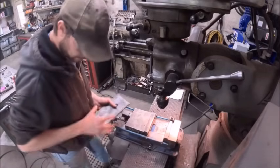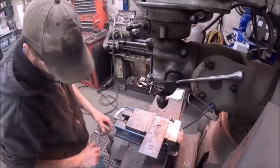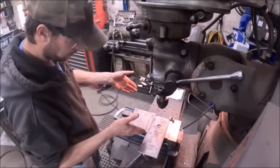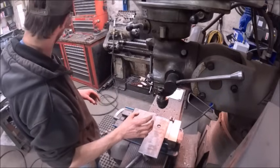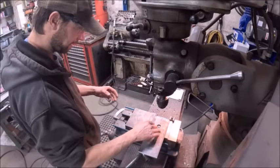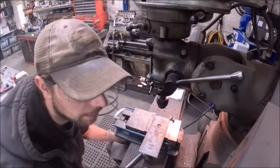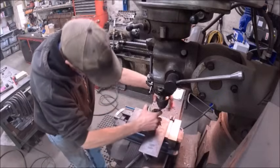So as far as this piece goes, we actually have to move down another quarter inch because the valve is 3.5 square and the center of the strainer is 3 inches. So in order to keep everything on a level plane, if I stayed up at 1.75 inches for the center, everything would run uphill. So to keep everything level, this has to move down another quarter inch. And the hole gets bigger.